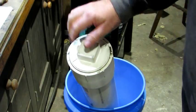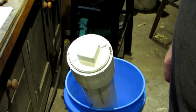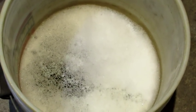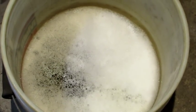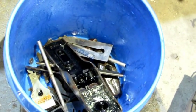It's going to sit here in this container for about two hours. I'm going to check it — the instructions say two to twelve hours. There's not a whole lot of rust on these things, so I'm thinking two hours will do it. So it's been an hour and forty-five minutes and I've got stuff I've got to do, so I cut the two hours short. I poured the EvapoRust back into my five-gallon bucket where I'm going to store it, and I transferred all the other parts into another five-gallon bucket to rinse them off.